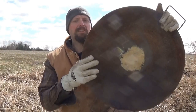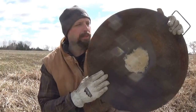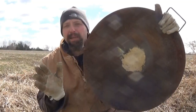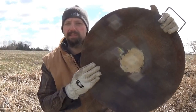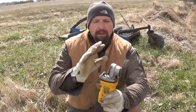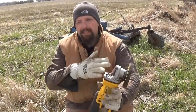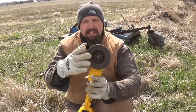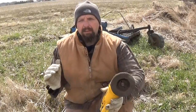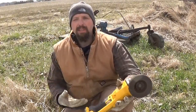The welding didn't take that long. I spent more time grinding it down and getting a nice smooth surface on the inside than I did welding. A welding shop can take care of this — it shouldn't cost that much and it's definitely going to be worth it. Covered on this disc is a heavy coat of rust, but it's still solid metal underneath. These things are designed to have hard lives sitting out in fields. When I was grinding, I noticed a little bit of red paint — could mean it was a Farmall originally, or a Case. Doesn't really matter who makes it; you're looking for old, vintage, and heavy. The next step is to strip off all the rust using an angle grinder with a 40-grit flapper wheel.